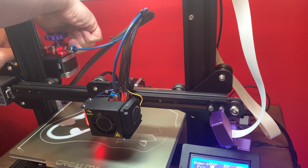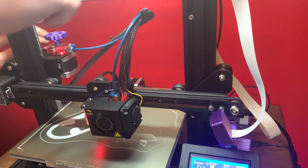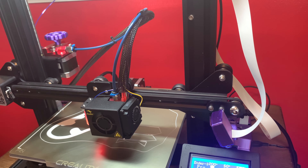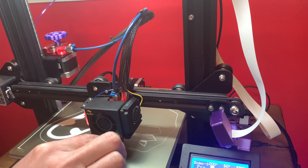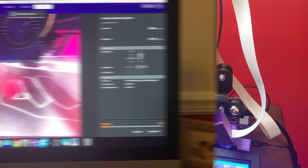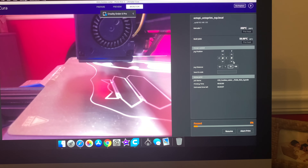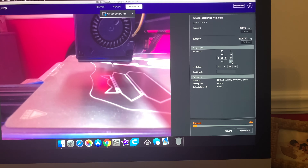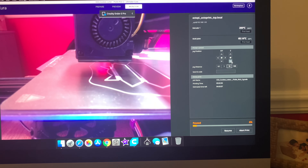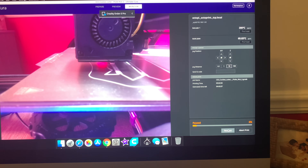I can see that it's oozing out a little bit. Now that it's oozing out, I'm going to reach in there with my brush and clean the filament off, then snip this little blob that it made. Now I'm going to go back into my computer and finish the print. If you guys remember, we raised the Z axis up twice, so now I'm going to push it down twice, and now I'm going to hit resume print.